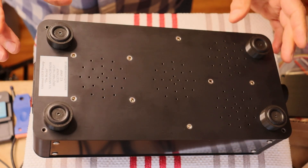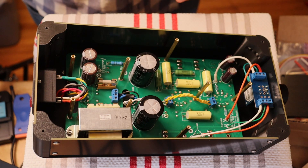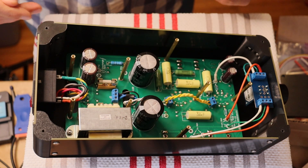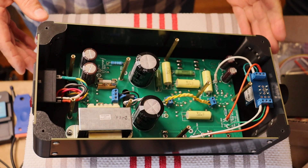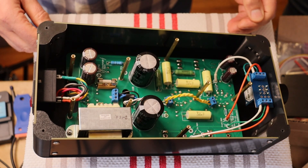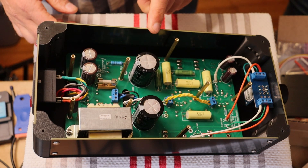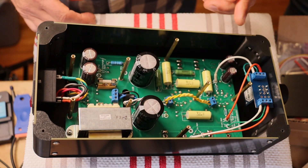Here's the bottom — we've pulled all the chassis screws. One of the interesting things about the chassis of the modern line is that it's a unified design, so every component basically links up with every other component, helping to reinforce. It's very structurally rigid and strong — I like to call it the sandwich build. That means the preamp is lighter and less expensive to ship, and it doesn't affect sound quality. In fact, it's extremely well shielded because the panels have copper on both faces.